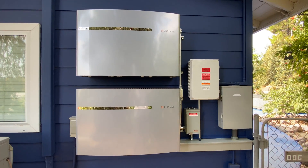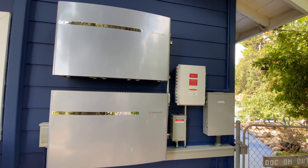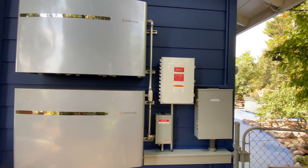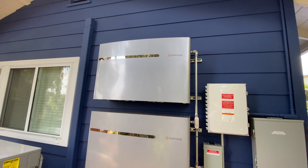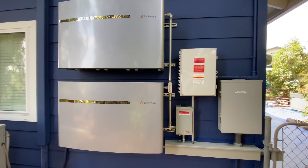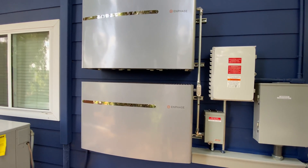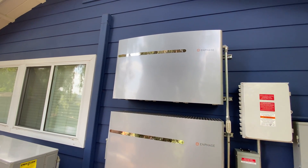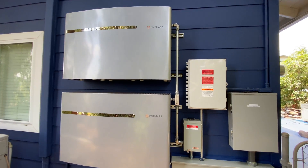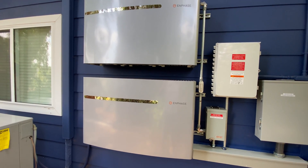Dave here with WeBuild San Diego. We've just finished our very first Enphase Ensemble system. This system just launched not even a month ago, so it's brand new to the market. What this does is give you the ability to store power from your solar on the roof and use it in an off-grid application, so when the power is out some of the home will work. You also get to use it every day to combat time-of-use — the batteries charge when the sun is up and the house uses the batteries from four to nine PM, when electricity is most expensive, so you're not importing from the grid during those hours.